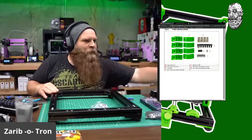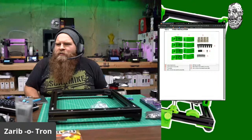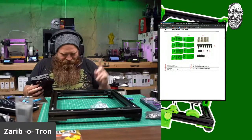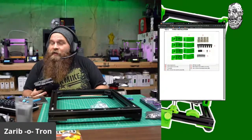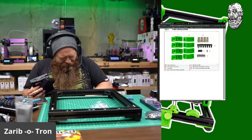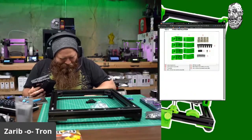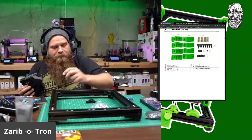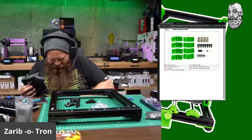And Chris needs to grab printed parts. I do not need cooling if I'm running it over 1 amp. Tested it over here on a printer. The 2209s actually run very cool. I was running them at about 1 amp, 1.2 amps. Neither the motors nor the steppers got too hot.